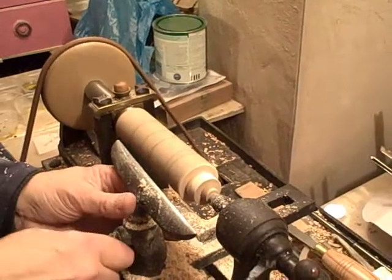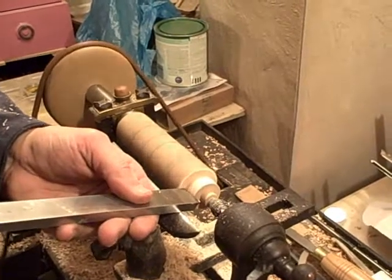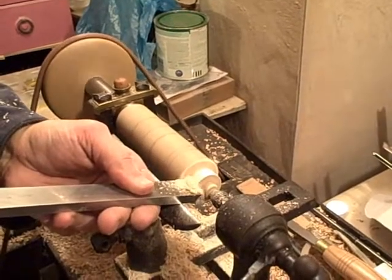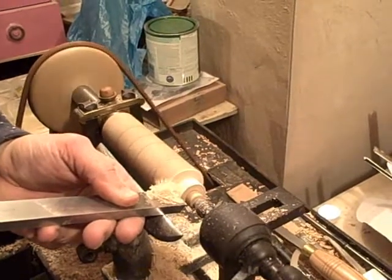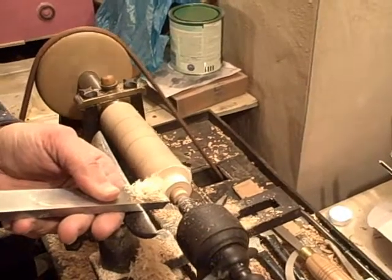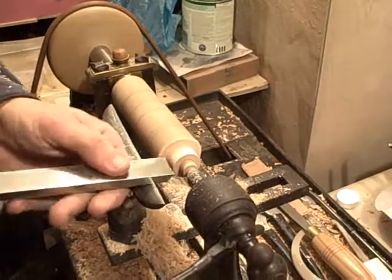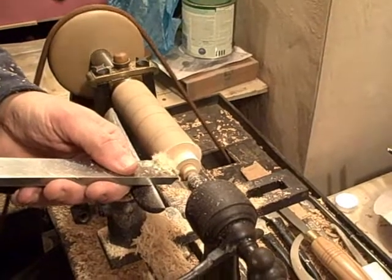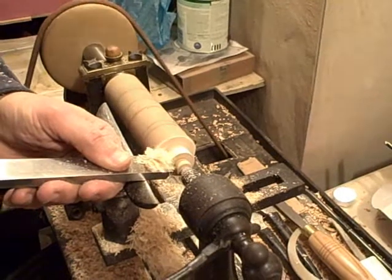Now that bung — another thing I've done with that bung is to arrange it so it's just a couple of millimetres above what I need it to be for that hole, so I know when I'm approaching that. This spout is starting to get to the point where I'm going to need to be a little bit more careful about exactly how much I'm going to take off. Now I can measure this, I can get my tools out to measure this, but the best measure in my opinion is the lid itself.